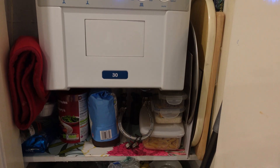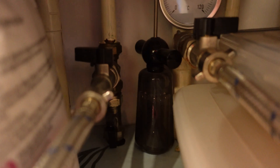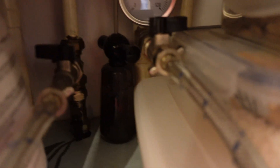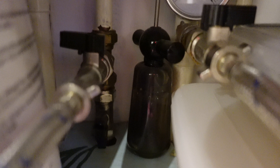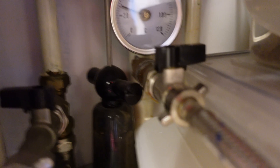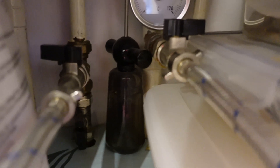I'll show you something that happened to me — it's very easy to do because it's something you don't really take into account. When you've got the filling loop connected, here's my combi boiler running away cheerfully on a cold day. Now look at what's around the filling loop taps — items and grocery containers. A while ago there were some dog bits in here too. What happened was one of the taps got nudged on, and then the other one was nudged on just a little bit, but enough for the pressure to rise and rise.